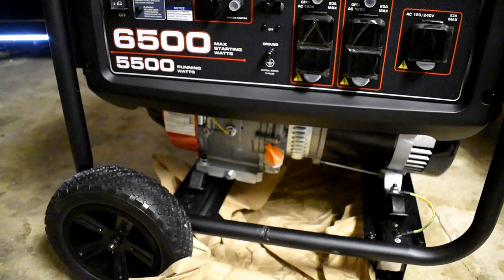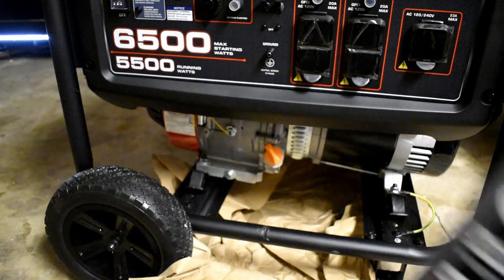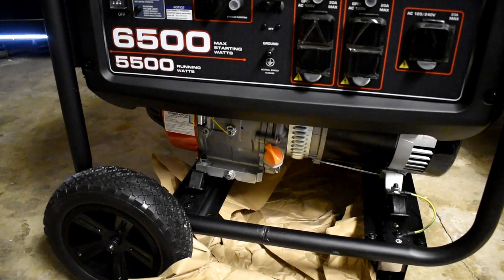Next we're putting oil in it — I'll probably regret doing this in the garage. We're going with 5W-30 full synthetic; it's the only oil they had. The manual calls for 10W-30, but says to use 5W-30 in cooler weather, and this thing will primarily only be used in cool weather. I'll show you in a minute the placard on the side that says to run it every three months to keep everything functioning or it voids your warranty. You're also supposed to run it for 20 hours before the first oil change.